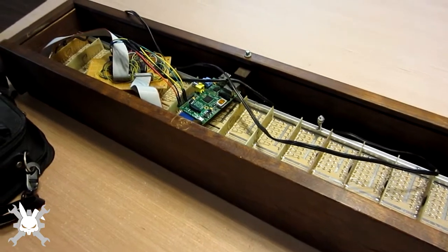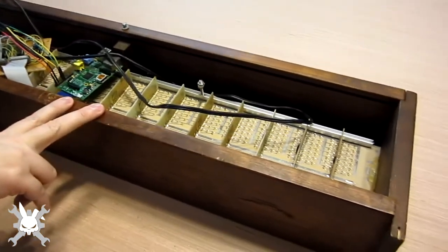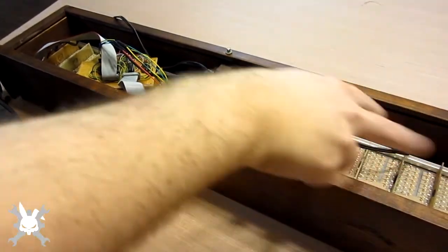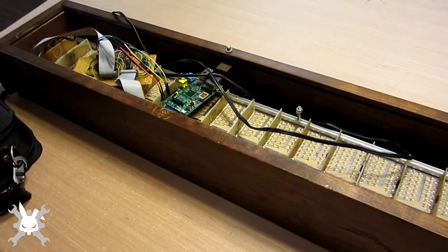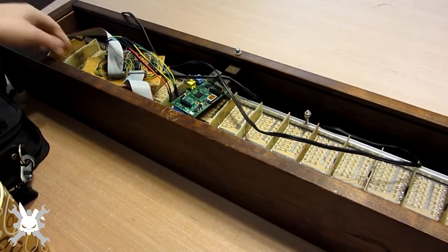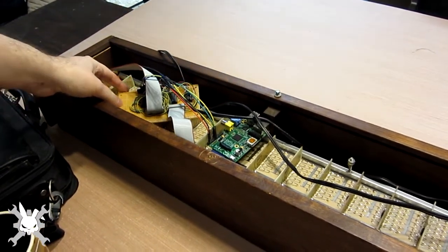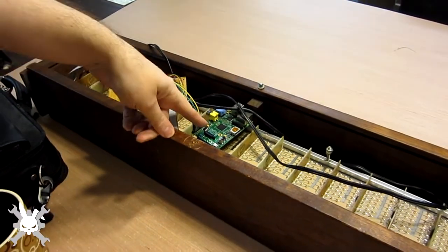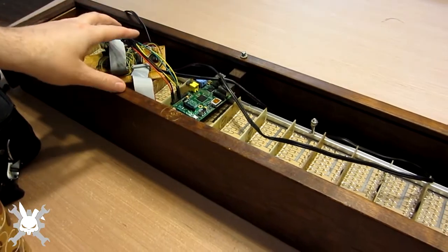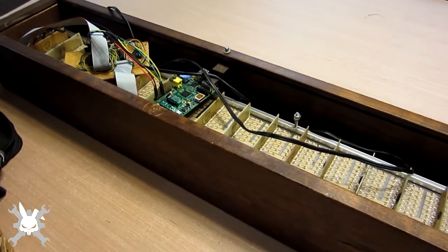Okay. So what is this? What's going on? Alright, so this is the LED sign that we've been hacking on the last couple of weeks. 16 characters, 7 by 5 lights on each one, or pixels. And we've done a lot of work figuring out how to address this thing, and I built this board here that is 32 bits of shift register output, and wrote a Python script for the Raspberry Pi that can actually put 32-bit numbers out onto it, so that we can write Python scripts to paint characters onto this thing.